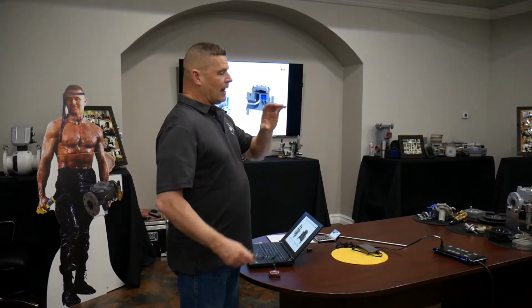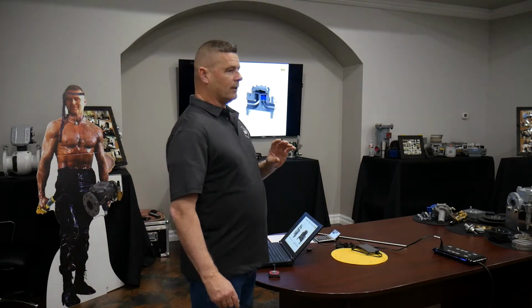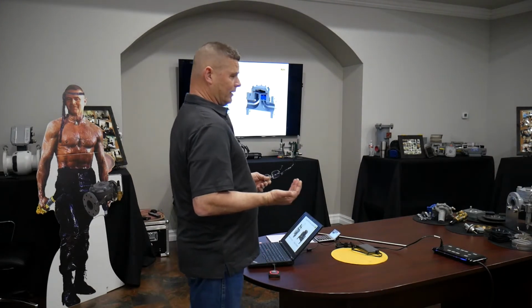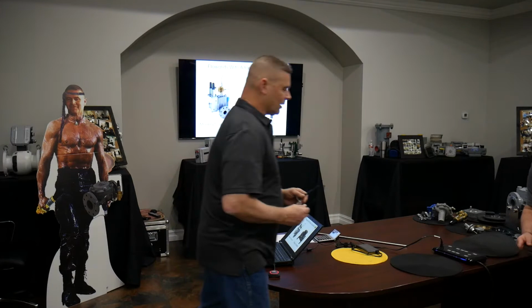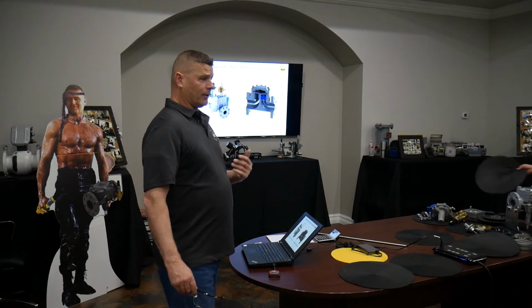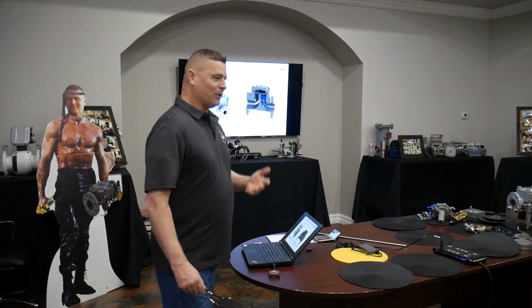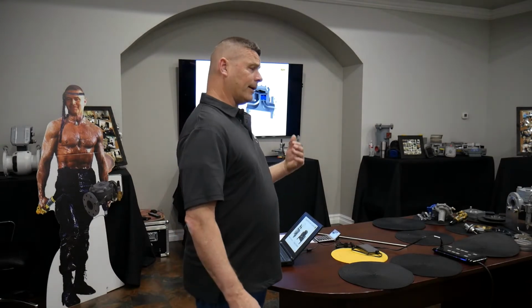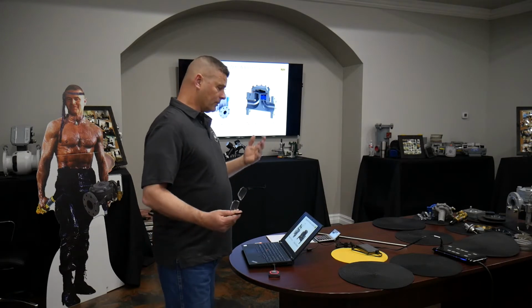Same thing with this other thing in the picture here, the noise controller. It's just another level that allows you to have that honeycomb style noise controller that can cut the perceived noise 27 decibels. There's always, when you're talking about noise controllers that are going in the body of a regulator like that though, a consideration of how that affects your capacity. You basically put a 50% throttle plate in place when you do that. So a lot of times if you're dealing with a noise problem, you're also probably going to have to size up the valve body size because you're going to need more capacity. Just an aside.